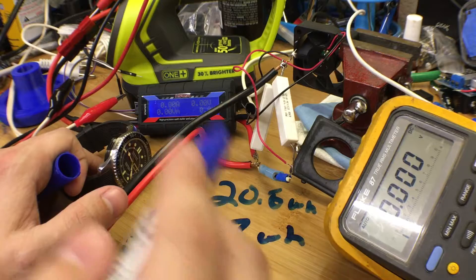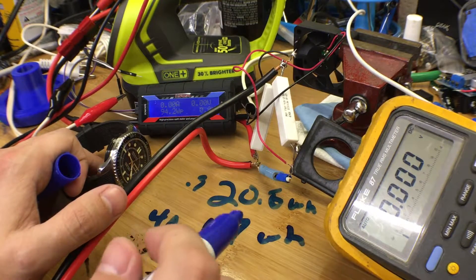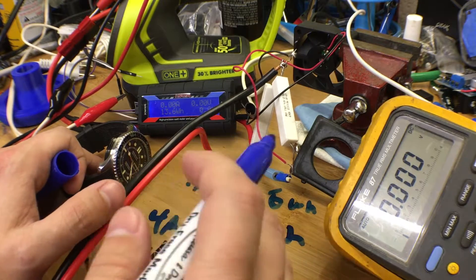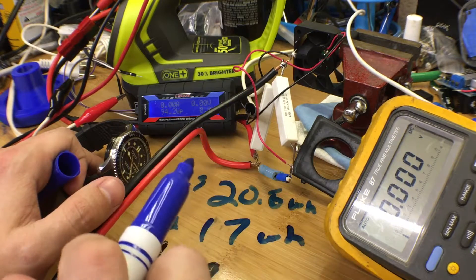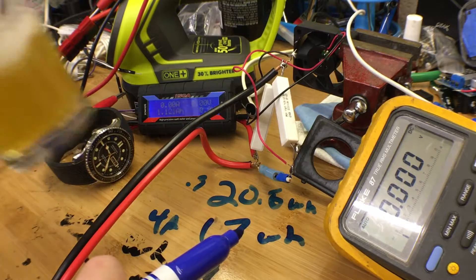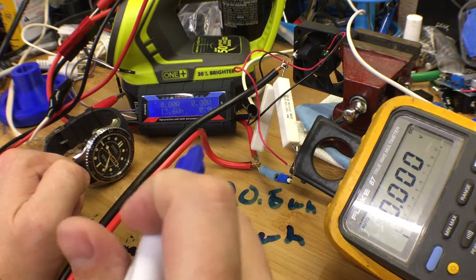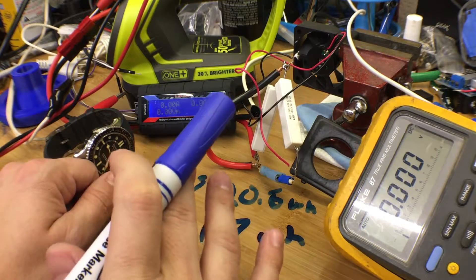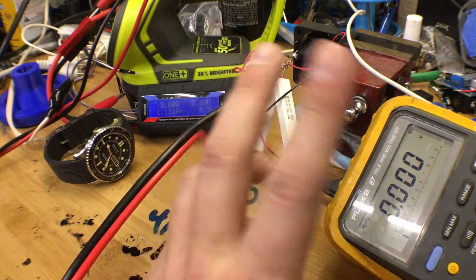At about half that current draw, we do see a reduction in watt hours — the usable capacity on that pack. Sometimes manufacturers talk about total versus usable capacity; sometimes it's software restricted. Here we have what I consider the closest I can come to an A-B comparison between low current and high current, and there's a delta. Sample of one with this battery pack, small grain of salt, but it's a data point. Would love to see your test, Johnny — I know you have the exact same battery pack in question. Feel free to hit me up.